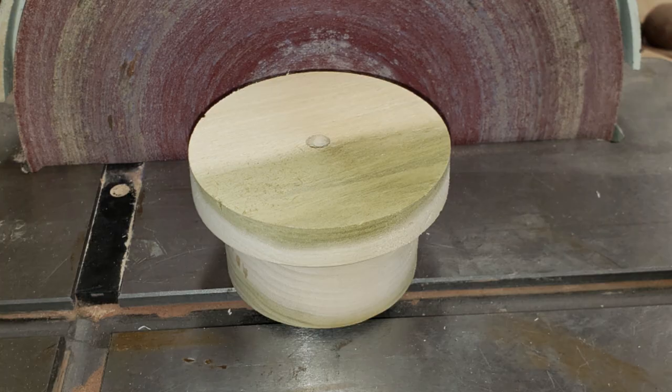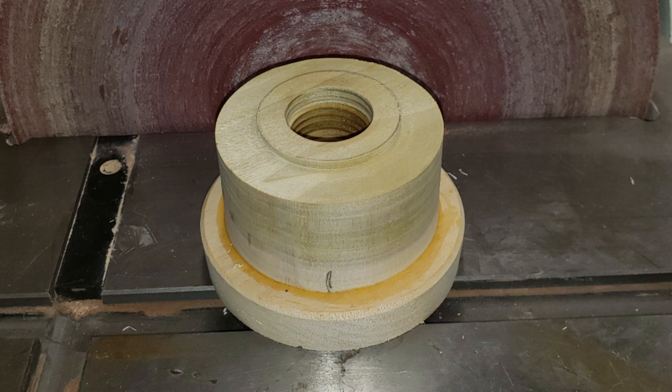For the mounting faceplate, I recommend a threaded wood faceplate. However, you can use many other types of faceplates. Whatever you use must be dedicated to permanent use for the chuck. In the description I will put links to other videos describing how to make and thread the faceplate. With your faceplate ready, cut a groove to fit the PVC fitting.